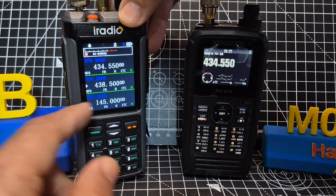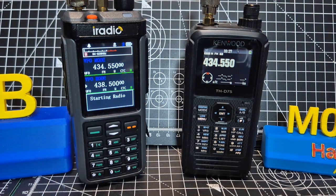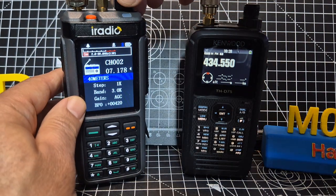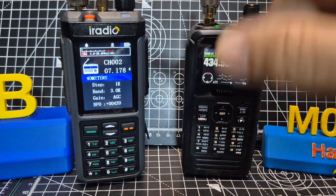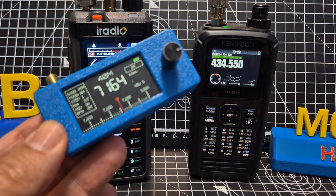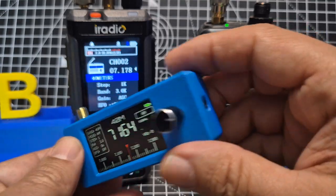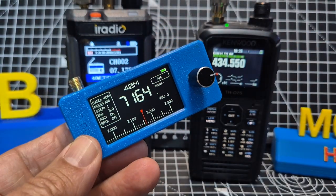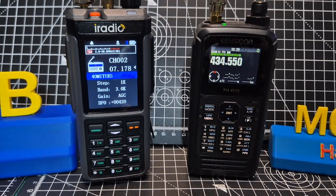So let's turn on the HF mode on the iRadio. You push the bottom button, it goes into the middle antenna, which is connected to an SI4732 chip that receives HF. The speaker is nice and loud. These chips are mass-produced now, so it's not really a big deal to put one in a radio — hence seeing things like this, which is produced for about £27 delivered with the case, and is firmware-upgradeable. It has exactly the same chip.